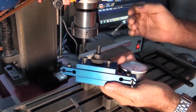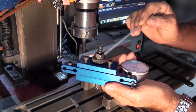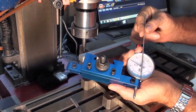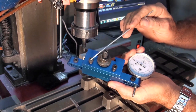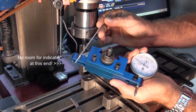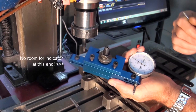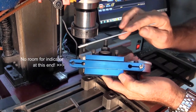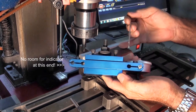Although the unit does work, it's a bit frustrating because you need to loosen these two socket head cap screws and move this arm backwards and forwards when you swap the indicator from one end to the other. The original intention was that you would never touch these screws — you'd just simply unclamp this end of the arm, move the indicator down and indicate against a face or a diameter. For someone like me who has Aspergian tendencies, that sort of mistake can be really frustrating — stay awake at night and worry about it type of thing.